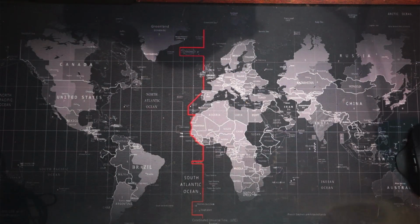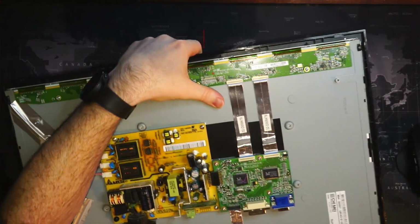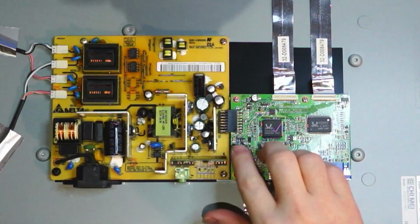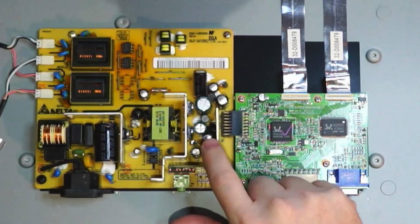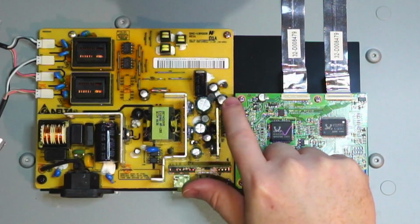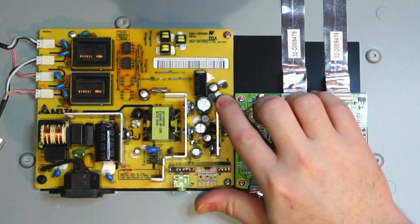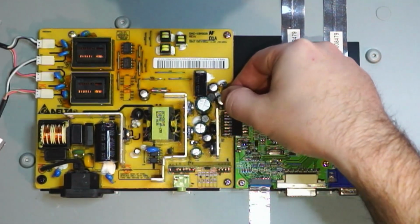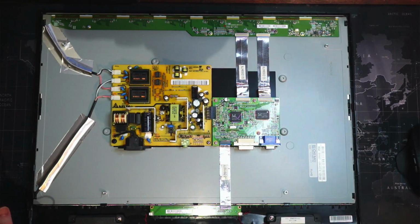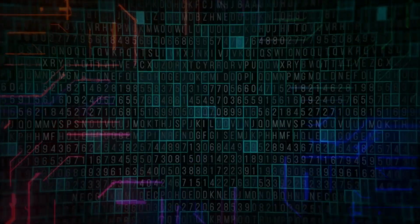When I opened it up initially, before I actually bought a new monitor, I thought maybe I could open it and see if there was something wrong with it, blown on it easily. And the conclusion I came to was there are a few capacitors on here that aren't quite blown, but they do have puffed up tops on them. So I'll zoom in and we can take a look at this here, or I'll show you the second camera footage here.